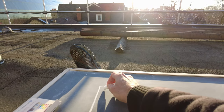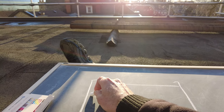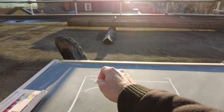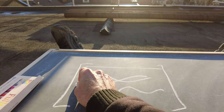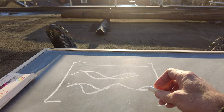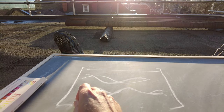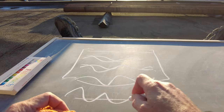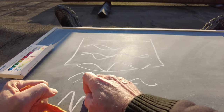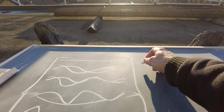You can think of it as, you've got the DC component here, and then you've got one cycle of a sine wave, and then two cycles of a sine wave and a cos wave, real part and imaginary part. Real part is the cos wave, imaginary part is the sine wave. And then three cycles, four cycles, and so on, and each of these is a higher and higher frequency. And we're multiplying by the signal that we have here.